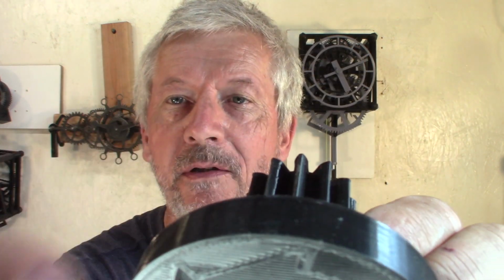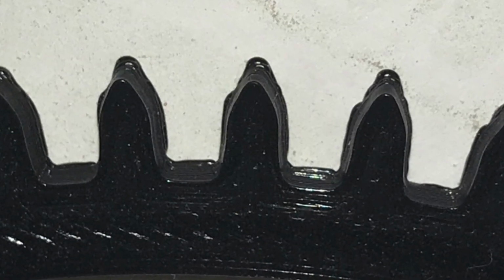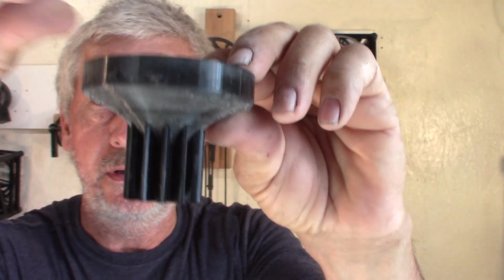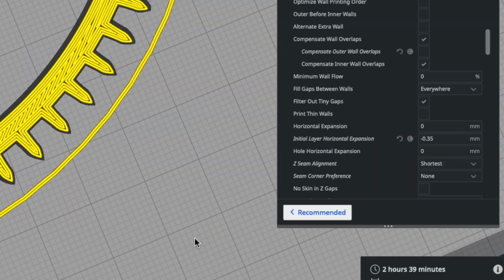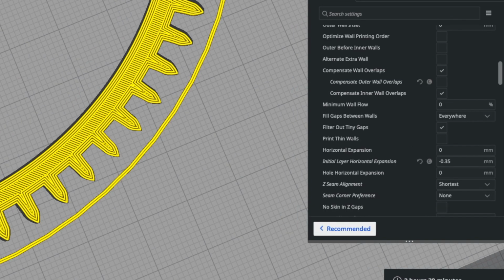Another thing that's pretty important when you print is what they call elephant foot, and you can see there's a little flat, wider space. The first layer was the bottom of the gear. I printed it this way, so it made an elephant foot. Most slicers have a setting. In Cura, that I'm using, it's first layer expansion. You put a negative value, so it makes the first layer a little bit smaller,